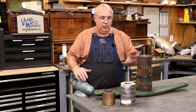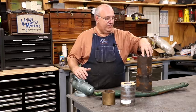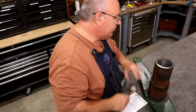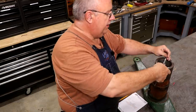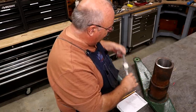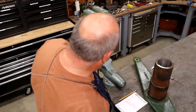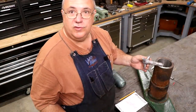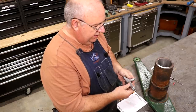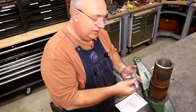That's the game plan. Before I get going turning, I want to get some really good measurements of the bore on both sides so I know what I'm going to be turning to. I'll quickly measure this with the calipers to get a rough idea — we're roughly three inches and three and three-quarter inches, roughly. That tells me which bore mic I need to grab. To measure this, I'm going to use one of these bore micrometers — a little three-sided micrometer. They're really handy for checking bores and accurate to within about half a thousandth of an inch, which is much more accurate than using a snap gauge.